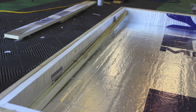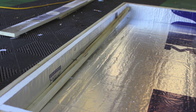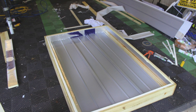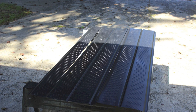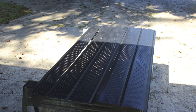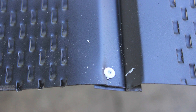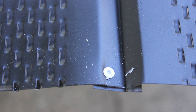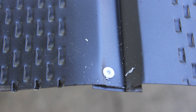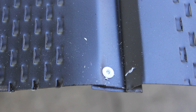You'll notice that these strips are on an angle — we'll get into the reason for that later. I cut my metal soffit material to size and spray painted it flat black. Once it was all dried, we connected the pieces together. I've seen many YouTube videos of people gluing or caulking them together, but here we just used pop rivets. It was quick and easy.